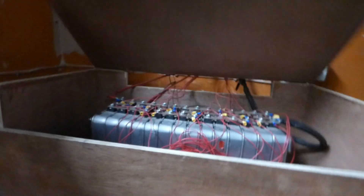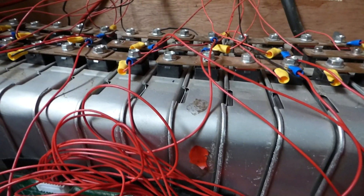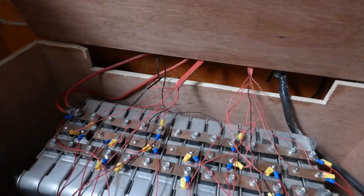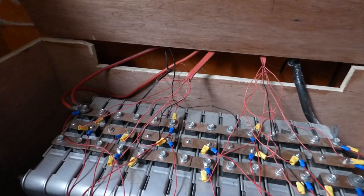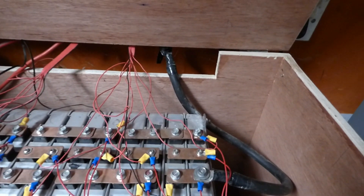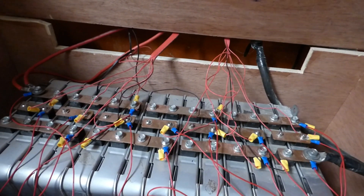We've built our battery box — it's supposed to be small but it's a little too big, as you can see. We have our balancer, which only balances when it gets to 4.17 to 4.18 volts and doesn't balance below that. I mentioned I have an equalizer and a balancer — I'll connect that tomorrow and run through it with you to see how it works. This is a 14S configuration; we connected two cells in parallel and then series seven of those pairs to give us a 14S battery.